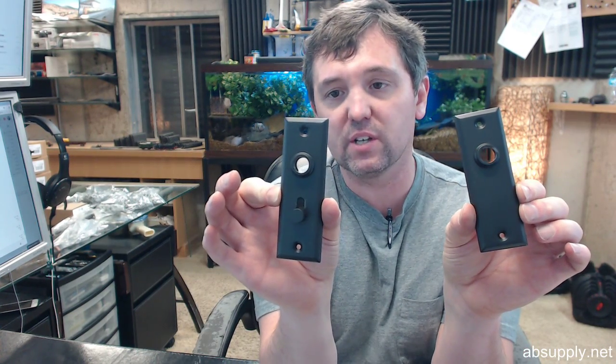This is an escutcheon set. What you're going to want to be sure is, though, before you're drilling those holes, is this. Be sure that when the main door closes, you have room to account for this lever. You don't want to have any conflict with either the door itself or the actual lock from the interior, from the main entry door. So be sure of that.